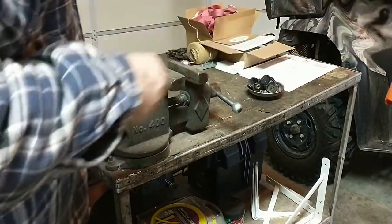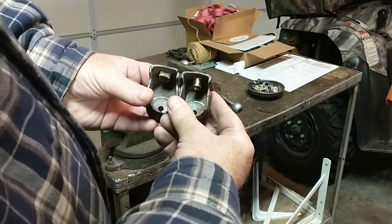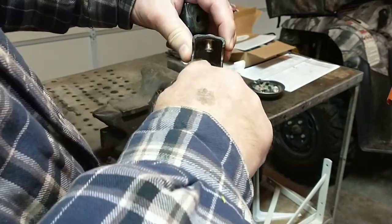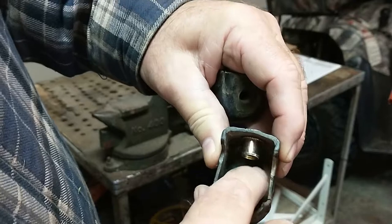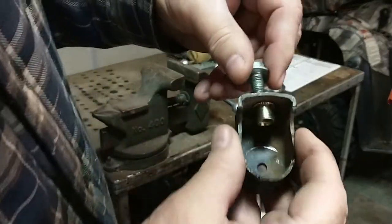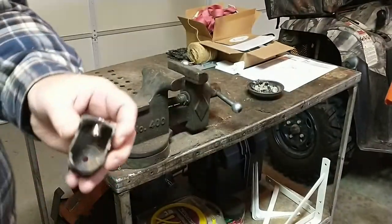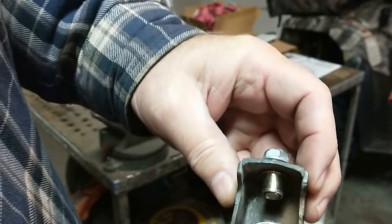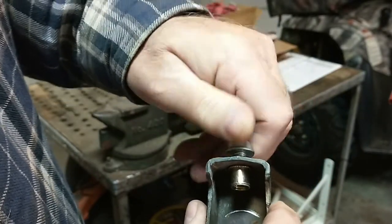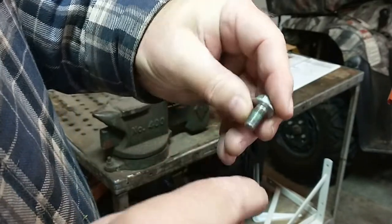Factory on the left, Aqua Dog's fix-it on the right. You can kind of see where the bar hits inside here — right in there you can see the cut line from the frame, so I've got that much room. You put the bolt in it — let's do it right-handed. There you go, goes in all the way. Even all the way tight it still doesn't stick through there, so I've got plenty of room if I wanted to use a longer bolt to get more thread bite. Looks like they used Loctite on these, so I'll need to get some of that.